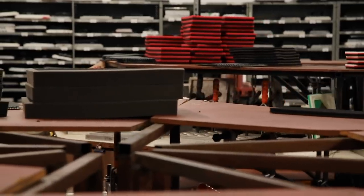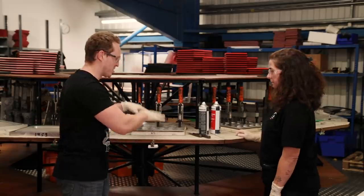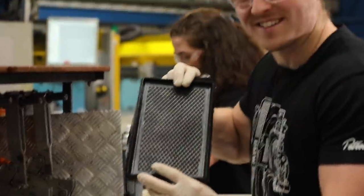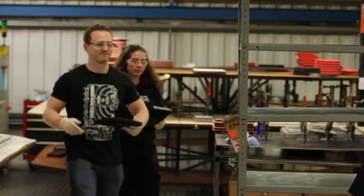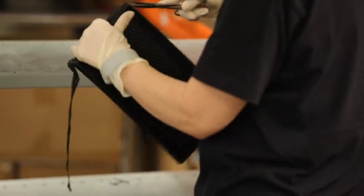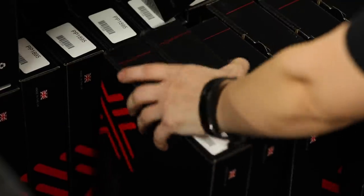While Matt slips away on his tea break, I'm back with Leanne. It's been around 20 minutes to half an hour, so these should now be rock solid. We basically take them out of the mould and check for any air bubbles or mesh being out. Then look at that — we've got the makings of a panel filter. With the panel filter now out of the mould, the final step is to pop it on a shelf, after which any excess rubber is trimmed for neatness, then it's vacuumed and popped into a wrapper to be boxed up, labelled, and sent to its new owner.